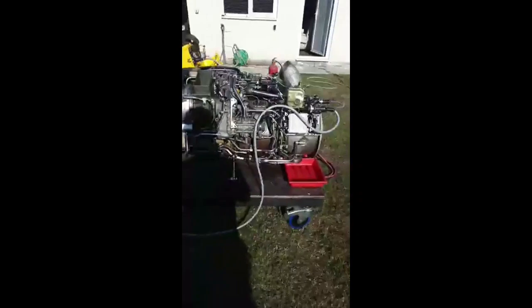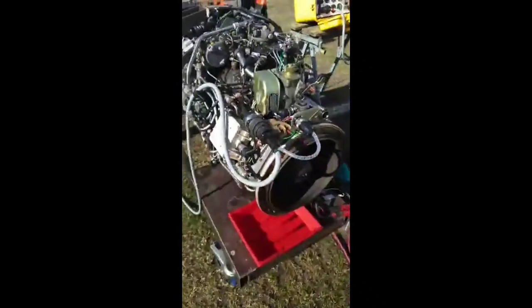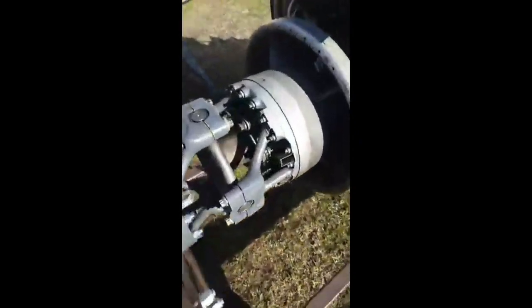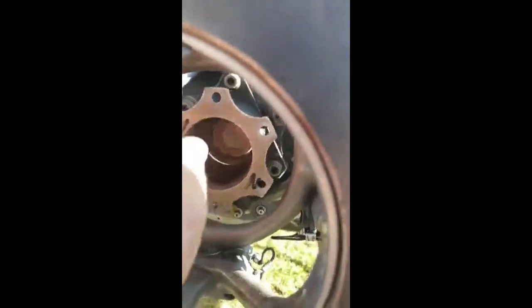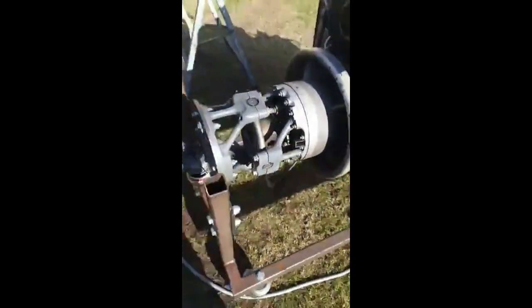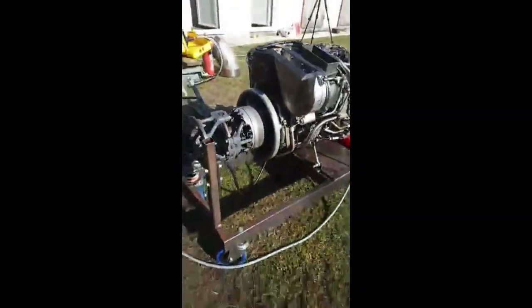And then about here in the engine is a power turbine. And I guess the way to think of a power turbine is a windmill being blown on, and then there's a reduction gearbox, and that gives you a shaft output. So you're looking at that and going, that's great, but where's the shaft output? Surely it should be at the back where the power turbine is. But no, weirdly, that shaft goes all the way through the engine and comes out to here, which is this bit here, if you can see that. So that is your shaft output. So the gearbox of the helicopter would be here, and that would couple up two engines. So basically the output shaft is right in the air intake, which maybe seems a bit weird, but that's how it is.